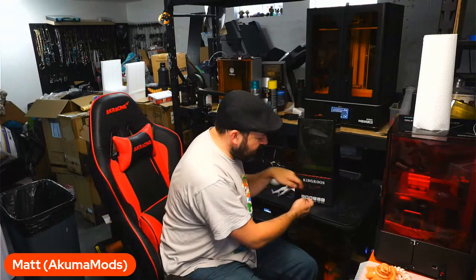I don't specifically like those type of leveling systems. That's more or less because over time — and in a very short period of time nonetheless — they tend to become unleveled, or they just can't be leveled. If your base plate is sitting at an angle, you're scraping off your prints. Usually when that happens, you're putting a lot of force on the upper leveling system. With those ball joints, they just don't tend to keep their grip over time. No matter how big of a screw you put in there, it's going to fail very, very quickly.